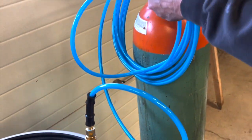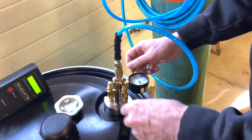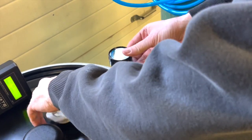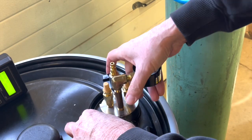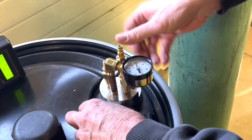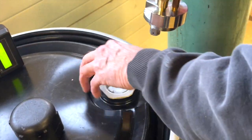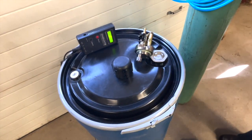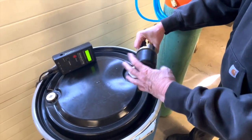So this is a foolproof system. Now we shut it down, turn this off, turn this off, disconnect the nitrogen, and remove this very gently. When the threads are loose, put the standard plug in place and tighten it up. All of the air is purged from the top of the liquid in there, and we put the storage cap back on.